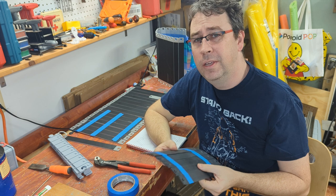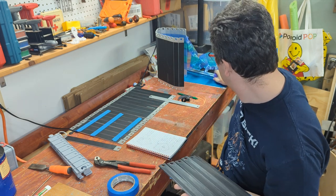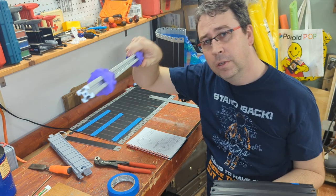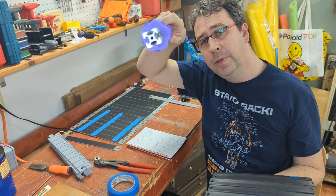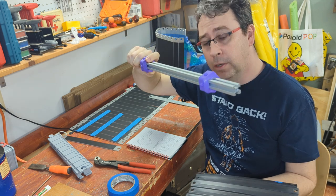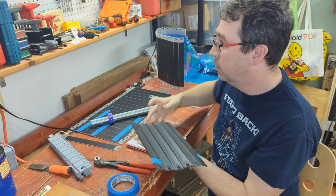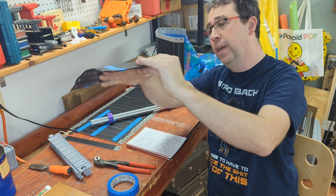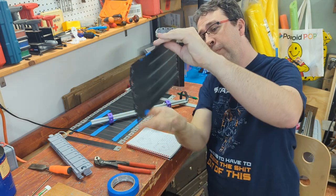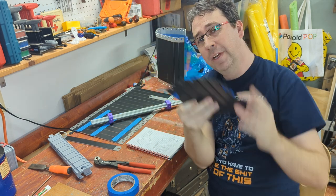It's worth noting that the angle is based on the drive rollers. My drive rollers have 5 sides, which I only did because the fewer sides you have, the thinner your overall belt thickness. You could make these rollers quite large, and then the angle between each tread would be fairly small. You can imagine them rolling around something like a coffee can. And while your bed would then be a good foot thick, you wouldn't need to cut the belt treads very much.